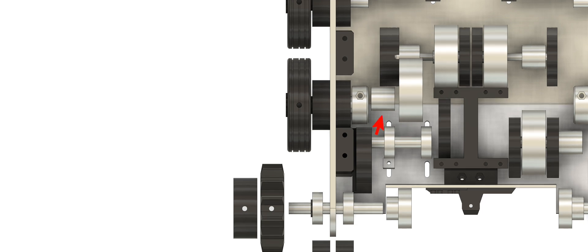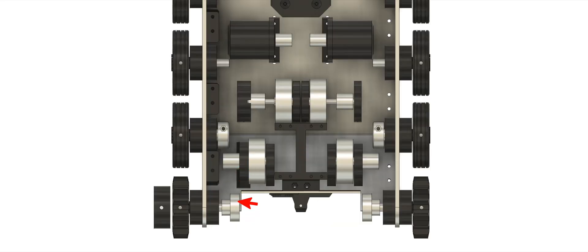The 20 and 40 teeth pulley are connected with a 150mm long, 6mm wide belt. The other two belts are both 200mm long with the same 6mm width. For the first pulley pair I used a 5mm precision shaft together with 605ZZ bearings.